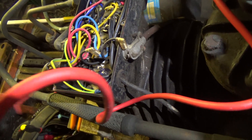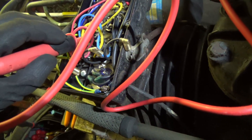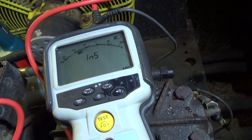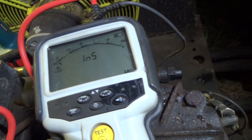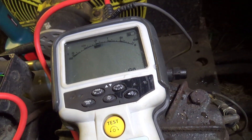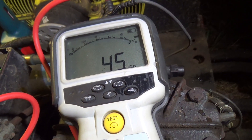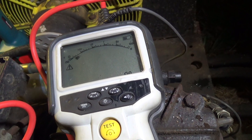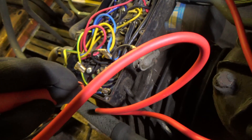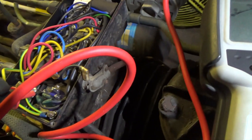We've got our three-phase wires off of the winding connections. We could test either one — that's going to be good, you can tell. Quick reading: 60 GΩ. They're all going to be something similar. Might be one lower if it's got the fan motor on there. And then we'll confirm we've got a good earth again — yeah, good earth. Right, let's go on the compressor terminals.